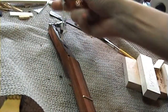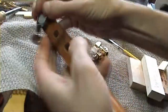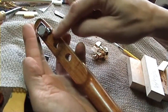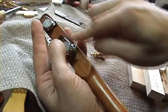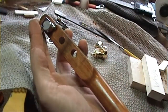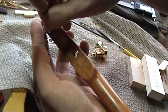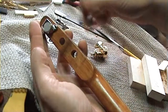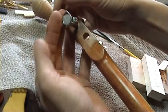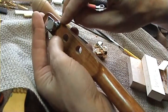We need the masking tape to protect our headstock. If we were fitting these type with the screw holes, you need to mark on where the head is going — it needs to be in the same line, so each one is in line. If you mark on where it needs to go and use a bradawl or an awl to make a hole mark, you can either pre-drill it with a one or one-and-a-half millimetre bit for the screw, or alternatively use a steel screw to make the initial hole and then screw it in.